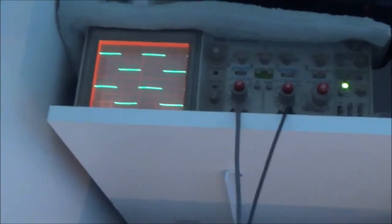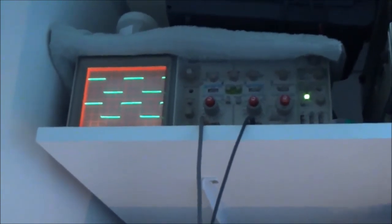Now feeding in a 2000Hz square wave, which checks everything from 200Hz up to 20,000Hz. It's looking good. I'd conclude that this receiver doesn't have any major problems at the moment. I'm going to leave it at that — I don't have enough capacitors on hand to swap out the tone control circuits right now, and I have too many other projects. Thanks for watching.